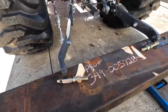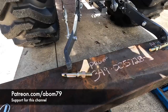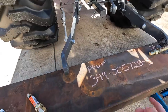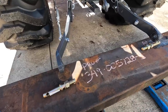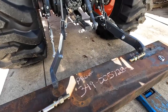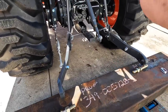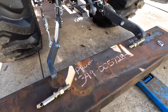I'm probably gonna go find me some material. I haven't rounded anything up yet, but I do have some thick flat bar that maybe I can use to cut out some ears, maybe torch out a couple of ears that we can weld to the plate here. So maybe have a couple of ears that are coming up and weld those on, that these pins will actually be bolted into. And in the center, I just got to come up with something else that I can raise this up. So when I was out there at the dealership this morning, I took some pictures of some of the brush cutters, and there was actually a rear mounted fork attachment where you can pick up pallets on the back. And the measurement that I got from here and up was about 20 inches. So I just got to come up maybe with a couple of flat bar brackets or something that raise up and get it up so that we can attach this one here as well.